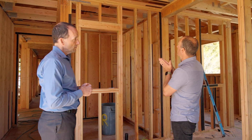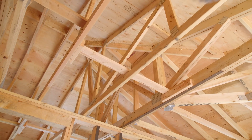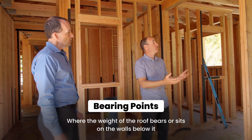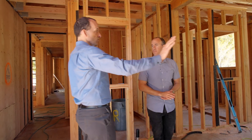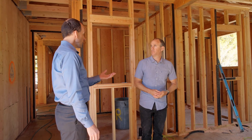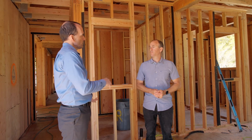Basically they press those plates on and it's like having 25 to 30 nails all in a concentrated area. The way trusses work is the load carries out to the exterior walls, so your bearing points are on both sides of the room. That gives you the opportunity to have a completely wide open room — your intermediate partitions are just not load bearing. These walls don't serve a structural function for holding up the roof; they're just holding up drywall and doors. So at some point in the future, if we're using trusses, we can actually take a whole wall out with no structural consequence.